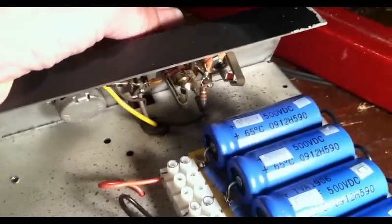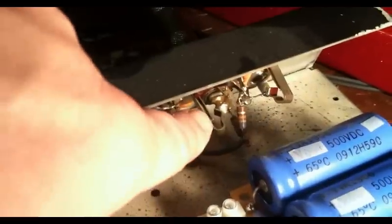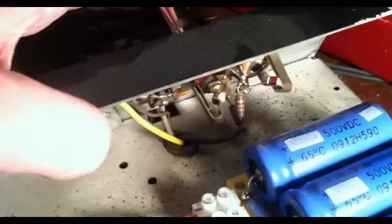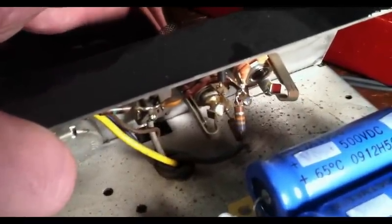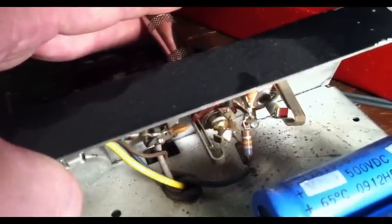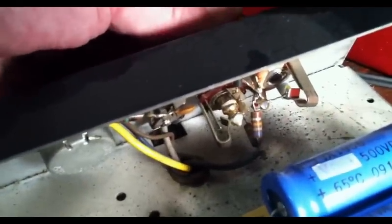if you suspect you're not getting good contact there, like this one wasn't, then you can actually input a cord into the jack, and you can watch very closely these two contacts. Now, if this inner contact, which goes to ground, moves at all whenever you plug in a jack, in other words, if it moves outward, like you see right there as I'm pushing in, it's moving outward with the tip connection. They're moving together somewhat before they separate. Now you can see there they're separate. Now if I release the jack, you can see that they do indeed touch at one point, and this one is actually physically moving this one, so you can see that it is making a physical connection.